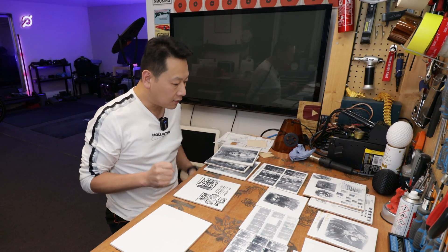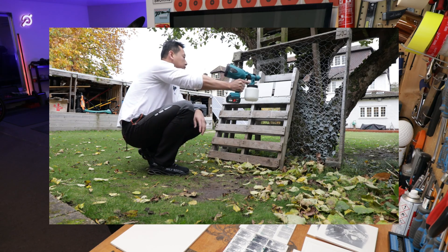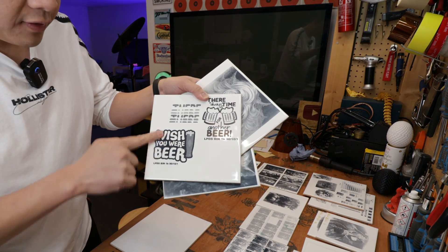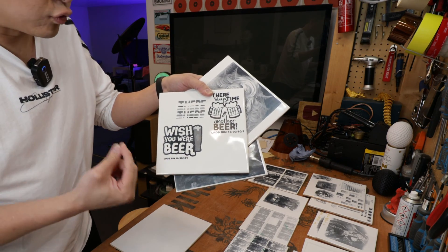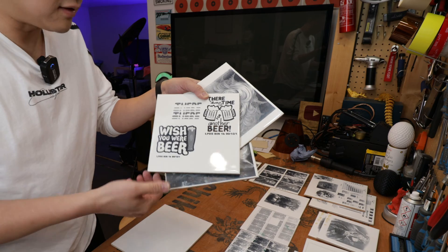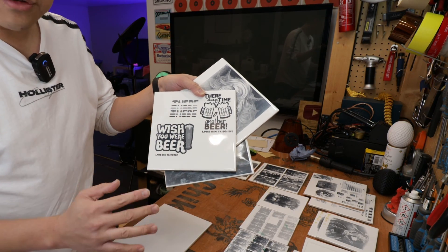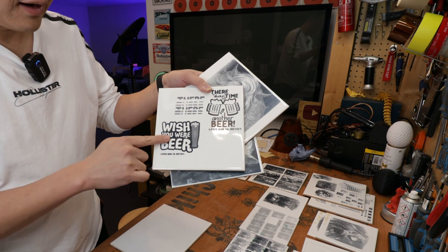The method I use here is a spray-on powder and ethanol — alcohol. It's different from a can spray. What we have here is a very rough surface where the titanium dioxide actually fused with the surface of the tile. This is using the beam function on the LaserPecker design space software — basically a continual beam of laser with no change in power, just left-right. So it's either on or off — you can see no shading there.